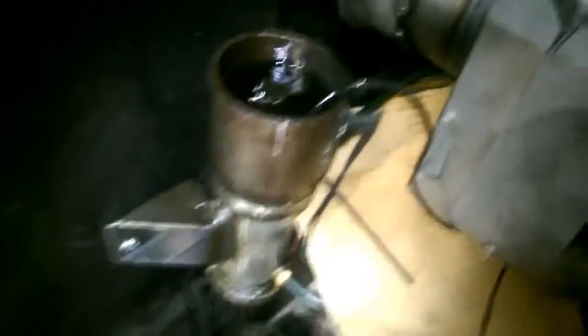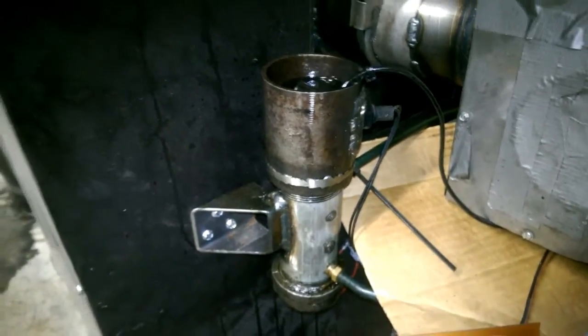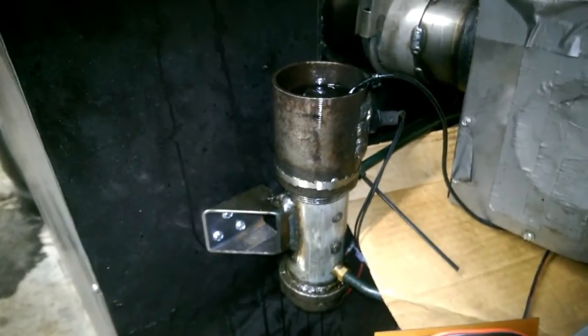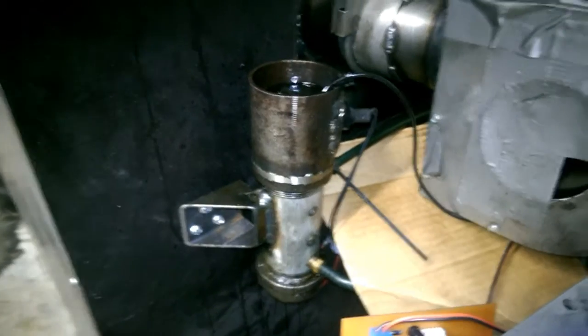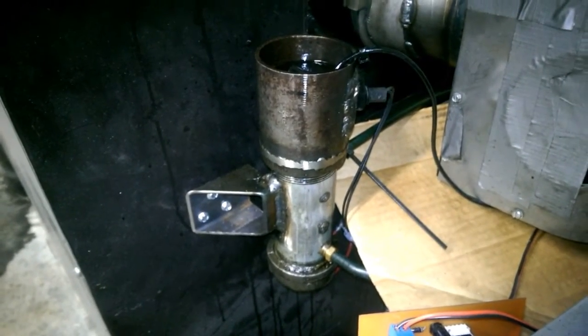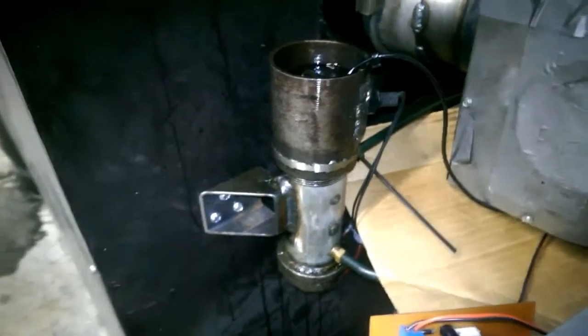On my float tank, just a couple pieces of pipe would be in and out. There's a water heater element in the bottom of it, which is way overkill for what we need. Really, a little 200-watt cartridge heater with some fins on it would work. But I got the water heater element in it, and the smallest one I could get was about 1,200 watts.